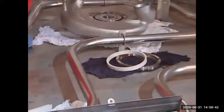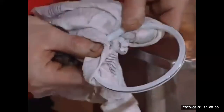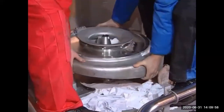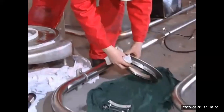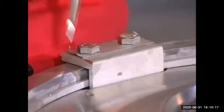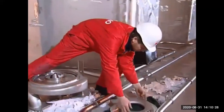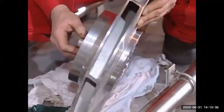We then remove the wear ring and wear locking ring. Next come the seals — the double lip seal and O-rings. We reverse the direction of the volute casing and remove the other wear ring and the suction funnel from below. Then we open the other parts of the impeller. The suction funnel cover is removed, and we can see the impeller and volute casing; the impeller should be clean.